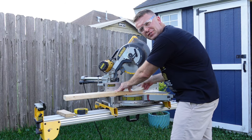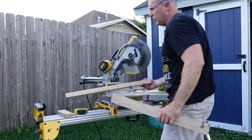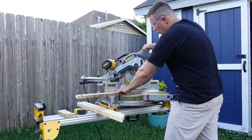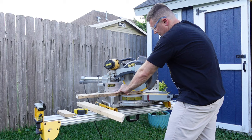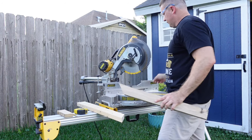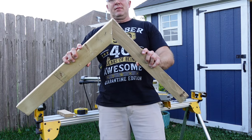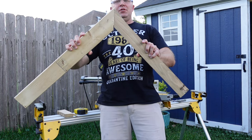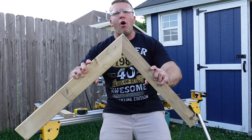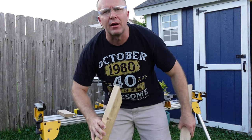I love the smell of fresh sawdust. Alright, here's our 2x4 cut — 3½ inches wide. Here's our pallet board — 2⅝ inches wide. See the issue here? The miters are good, but look at how off that is. You can't have this. We must fix it.